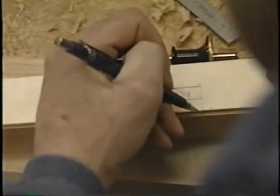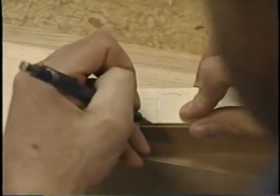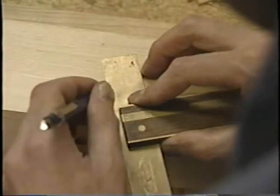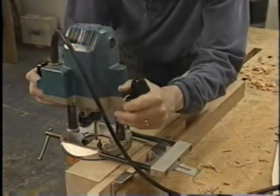It gets just a few smoothing passes, so there's little risk of angling the surface where the tenon will seat. Now I'll mark out for the mortises that will receive the back slats. Since their position is referenced from the angled back face of the rear post, I've had to wait until now to cut them. I transfer all the marks from my pattern again.